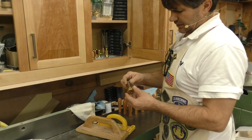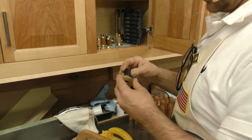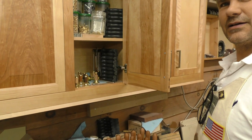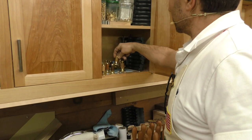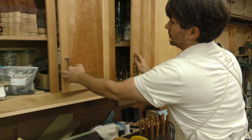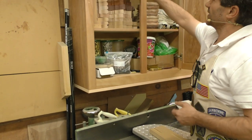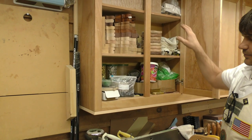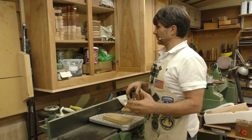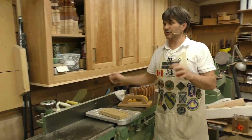These are various marking gauges. This one is Bocote. There's one out of — actually, that's a piece of Brazilian rosewood that I found in an antique store; it was a level. And then there's a piece of fiddleback Catalpa. These are all handles I've been working on — all the nuts and bolts and bits and pieces. This one is Padauk. I have a friend named Sean down in Pennsylvania that resin impregnates some of the handles for me. They put it in a vacuum, take all the moisture out, and replace it with a polymer resin which plasticizes the wood, increases the weight — which is the big thing.